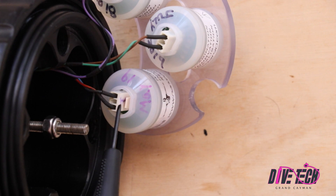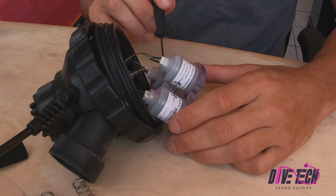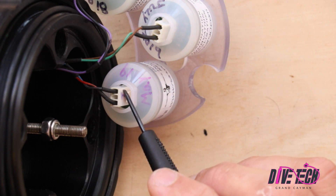There's not a lot of material to grab here with your fingers. So what people have a tendency to do is grab it by the wires and pull it out that way. That's really bad because what that can do is rip the wires from the connectors in there.